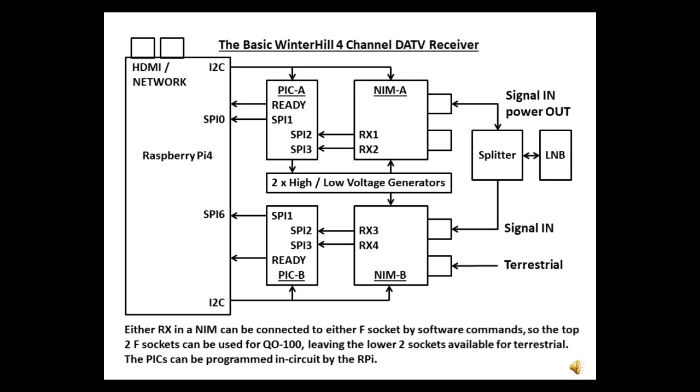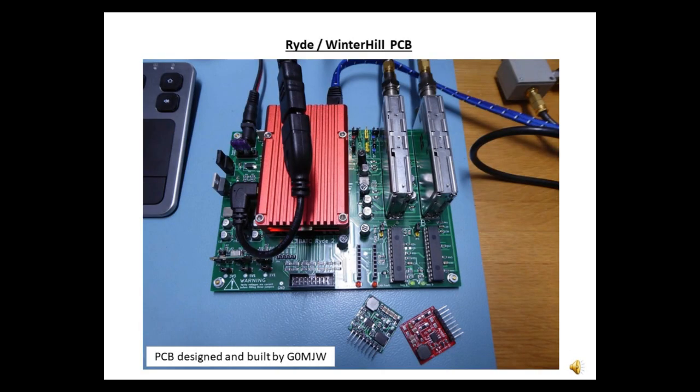The SPI-6 port on the Raspberry Pi is twinned with the PCM port. This does have a slave mode, so I have some ideas for a small retrofit PCB that would enable reception at broadcast speeds. Here's a look at the development board — there are several surface mount resistors and capacitors, 1206 type, the largest, but there are no multi-pin surface mount chips, so it shouldn't be too difficult to build.